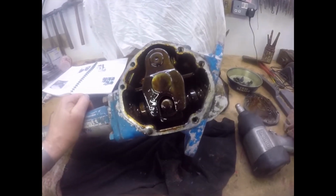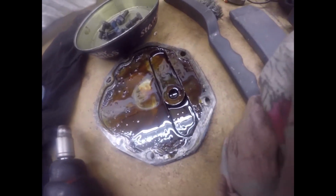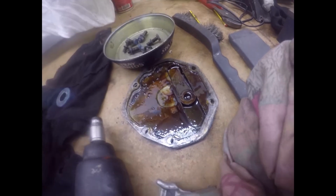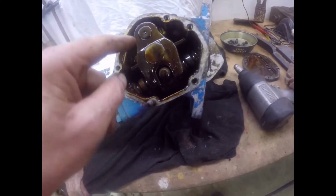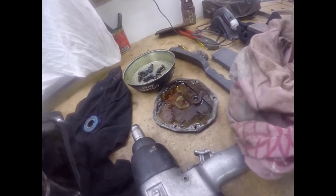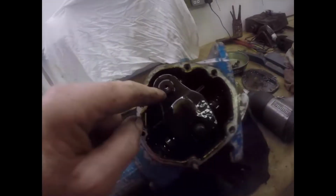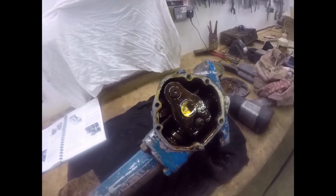That's the plate off. There is still oil in it. Also a lot of grit and crap. You have to be careful to hang on to the shims in the gasket, because they set the clearance for the pressure on that. So there you go. So the next thing we do is, well, I'm going to drain the oil out. Ease the rocker shaft out of the steering box housing. That is this. So I'll take that out and then I'll drain the oil out. I'll bring you back when I've done it.